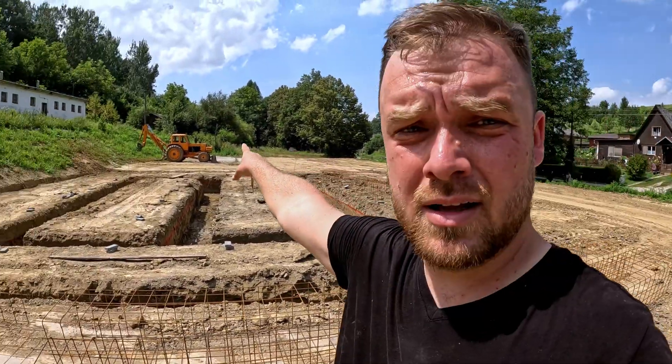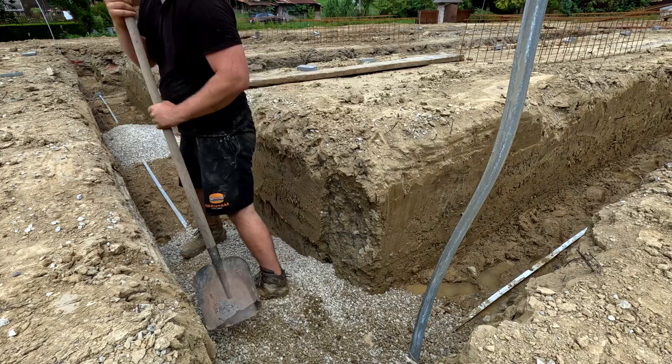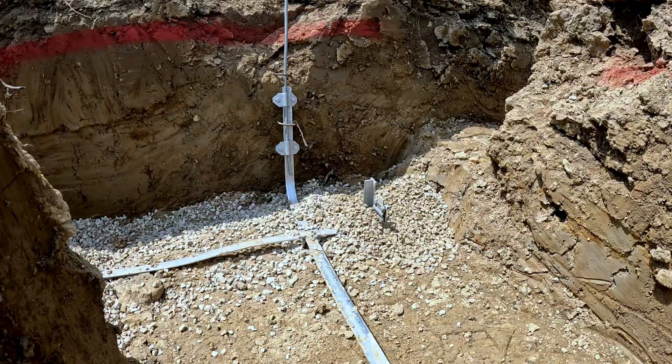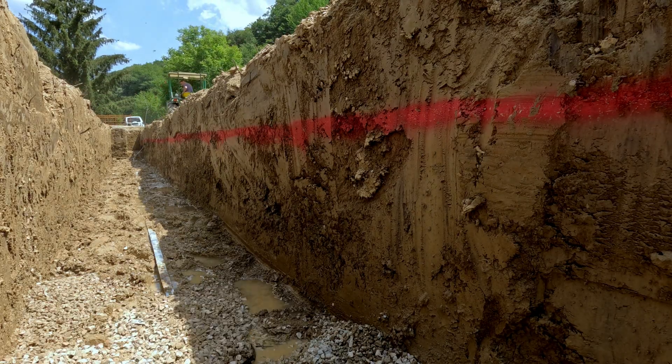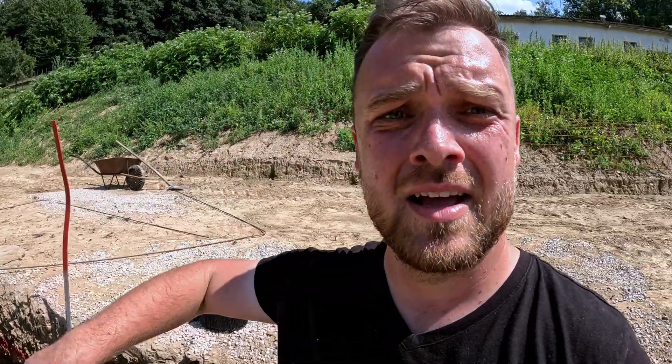The lightning rod system is all finished now. We will apply a little bit of gravel which is left from drainage and apply it on a spot where it's really wet, where there is sometimes water, to prepare a really nice and tight foundation for the concrete. Now we have a last step here. We are applying all the steel to concrete and now we have to connect it, wire it together, and it will be done and prepared for the pouring of concrete.